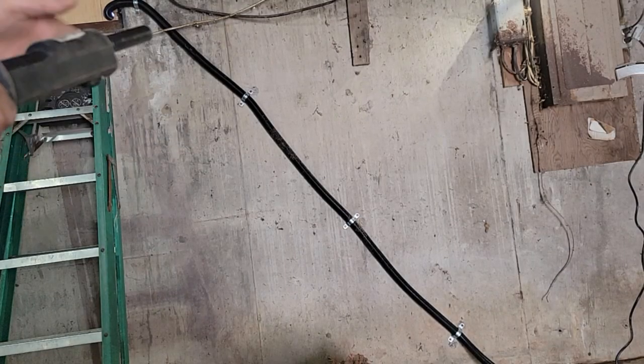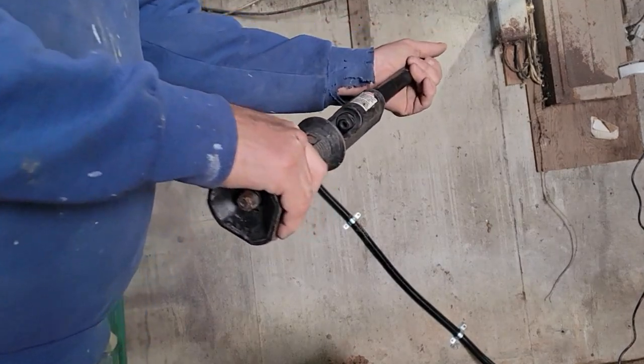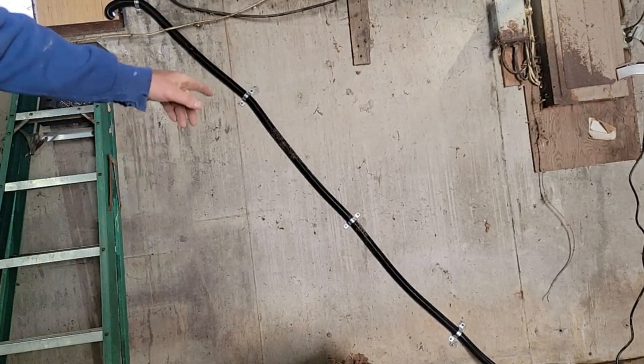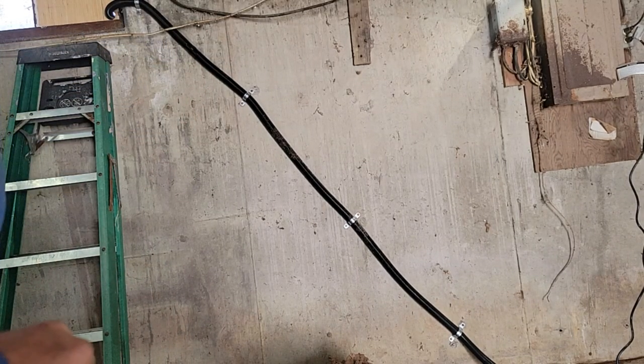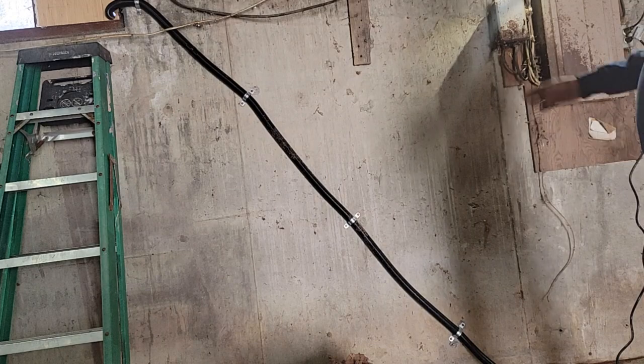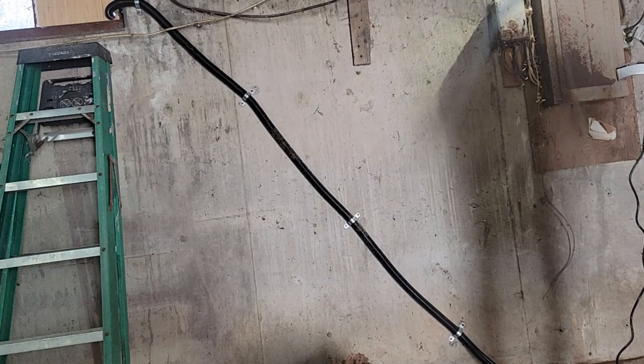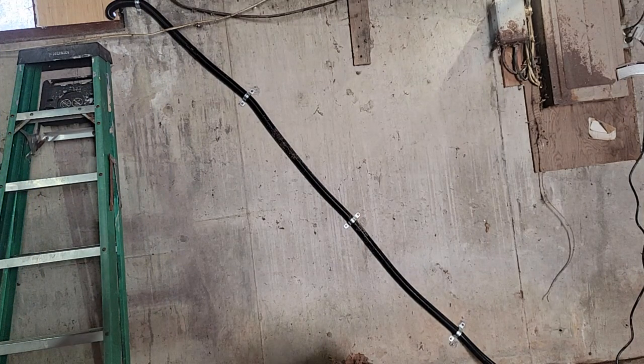Okay, I got four clamps on there. These ram sets work pretty good. I had one blowout and that's it. And that's where you go in and you hit like a stone or something instead of the concrete and it doesn't hold well. But now what I got to do is I saw the pump was working. You can see the hose jiggling a little bit. I want to caulk around that. I believe everything else here looks good. I got to put my bolts in the cover. I may not tighten them up, but just get them in there so the cover doesn't fall off if somebody steps on it.